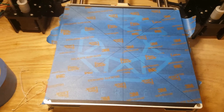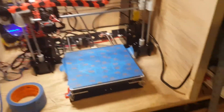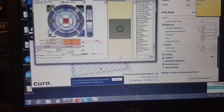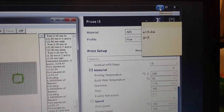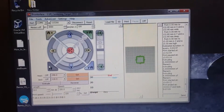Now I'm going to go into the Marlin part of my program. I'm not going to screen share — I'm using my laptop, that's why the USB cord is right there. I'm just going to show you off of my phone camera. I have a sticky note over here in the corner: my X needs to be at 3.26 and my Y needs to be at 2.26. So first I'm going to home everything from Pronterface — let me just click that.